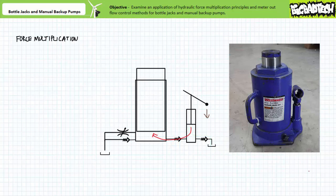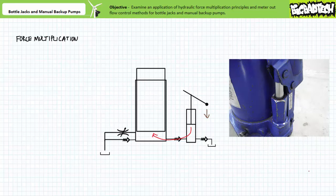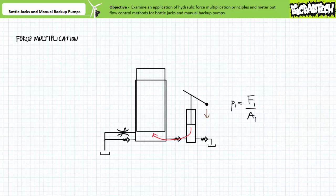When the manually actuated piston is displaced downwards, a region of decreasing volume is formed resulting in pressure being exerted upon the confined fluid. The area of the manually actuated piston is small, resulting in the comparatively small force exerted by the operator being concentrated on a much smaller area. Given pressure equals force over area, the exertion of this force on a small area results in comparatively high pressure. Fluid at high pressure is pushed into the system through the outlet check valve. Given the orientation of the inlet check valve, it remains closed, thereby providing a clear and definite separation between input and output. In summary, on the downstroke the intake check valve is closed and the outlet check valve is open.